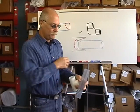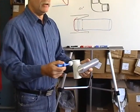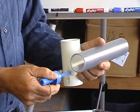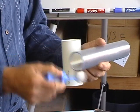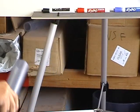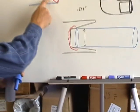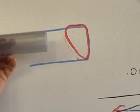Here's another very important step. When you do this, take your dauber and go around like this. I promise you, I have done millions of glue joints. Here's what happens: guys go like this and then the dauber comes away from the pipe and they go like this because everybody goes real fast. You can prove it to yourself — do this and then rotate the pipe 180 degrees, and what you will often find is that you have glue on the top but down at the bottom of the pipe, you missed.